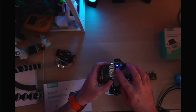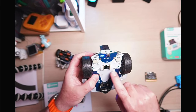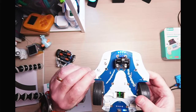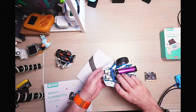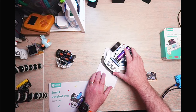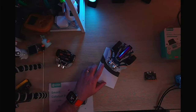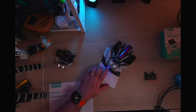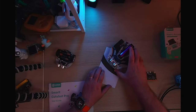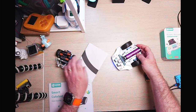On the front we can see the motor wires with encoders, the small caster wheel, and the training button. To calibrate the line sensor, press the training button, roll the robot over the black and white lines a couple of times, and the green headlights will illuminate to confirm it's detected and calibrated for those lighting conditions. Very easy to use.